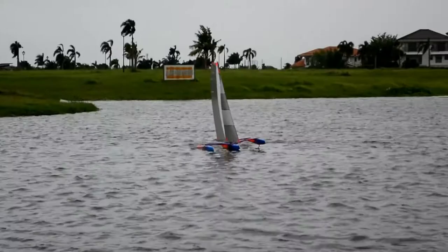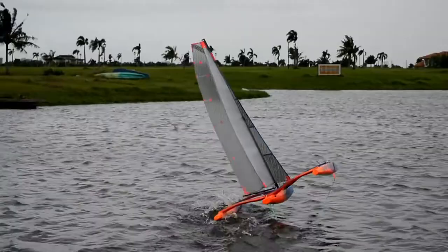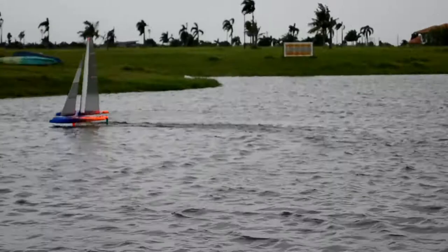The beauty of this system is that it is self-compensating. The faster the boat goes, the more lift is generated by the foils, and so the boat rises out of the water. But then there is less foil area in the water to create lift, and so the boat settles down lower again, until it finds equilibrium. In this way, it finds the correct ride height for any given boat speed.